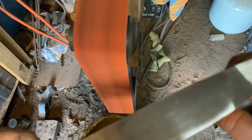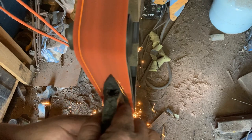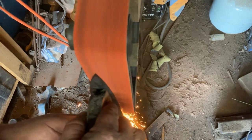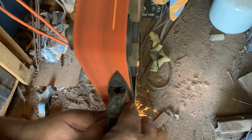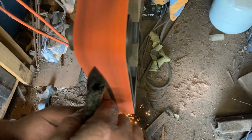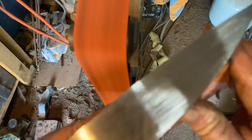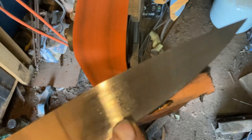We're going to start by cleaning up the scale from where we heat treated. Doing the top part first — as you can see there's a little bit of a patch in the center. Even with using the plate quench it still picks up those really slight bends that you've got to grind out. So just grinding the back and getting those pieces off, as well as the rest of the carbon scoring. Working the tip at the moment, dunking in the bucket because it's really high pressure grinding — we want to keep it nice and cool, not overheating it and not ruining the temper.